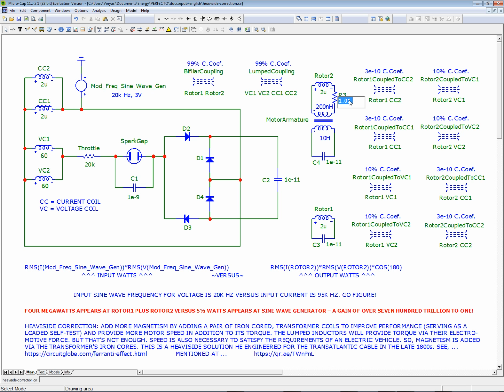Well, you know, you have two resistors that are in parallel. Your main resistor is 1 ohm, and then your tiny little resistors. Well, actually, no, you would just have a lot of 1 ohm resistors in parallel. If you can't get a high voltage or a high current resistor to be less than 1 ohm, then you just add a lot of them in parallel to divide up the current, such as I'm doing here.